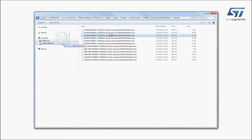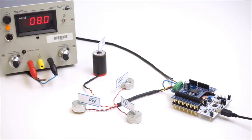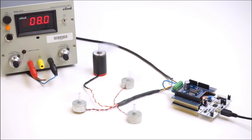Select the STM32 Nucleo Development Board you are using and drag and drop the binary file onto the Nucleo disk drive. Once the firmware is downloaded, press the blue button on the STM32 Nucleo Development Board and the four motors will run, each at a different speed, for two seconds and will then stop for two seconds. This will be repeated until you press the blue button again.